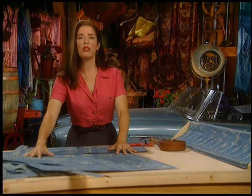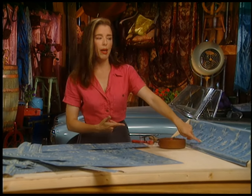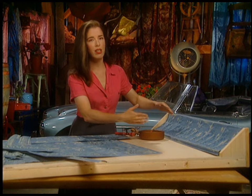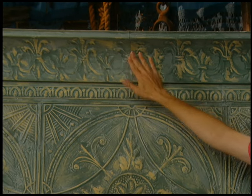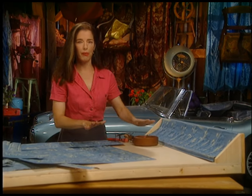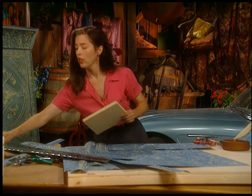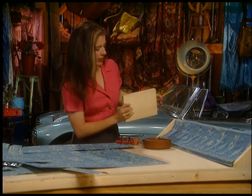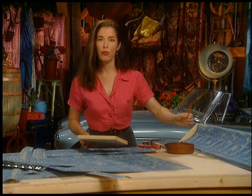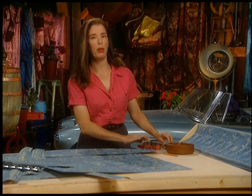If you don't have a single bed and are working with a very large bed for two people, you need to overlap two pieces of crown molding, because it only comes in four-foot lengths. For the big bed you'll see there's a joint in the middle — it's fine on its own, but with a joint it can wobble. So before finishing the two end triangle pieces, put a block in place, trace the profile, cut it out with a jigsaw, and put it right under the center where the two pieces overlap. Whenever you have an overlap, give it about a half-inch overlap so there's some strength there.